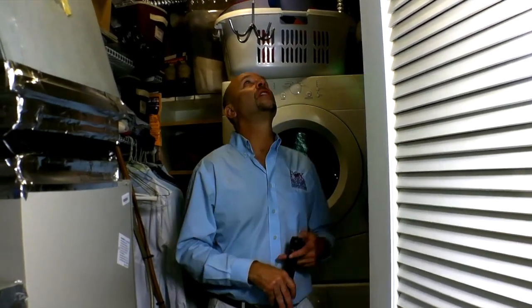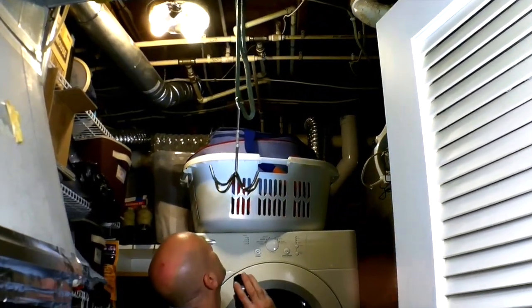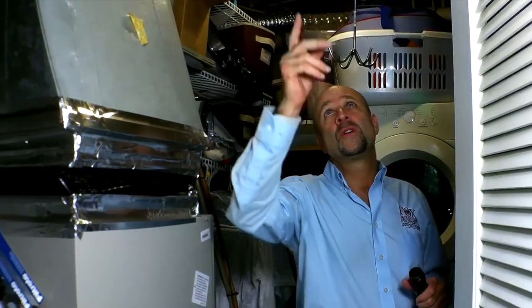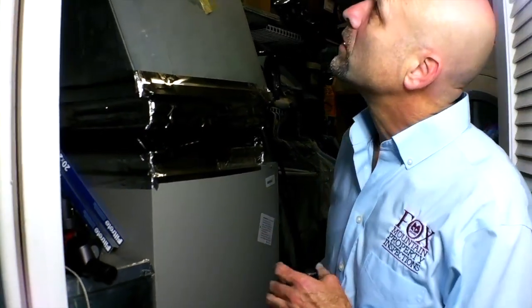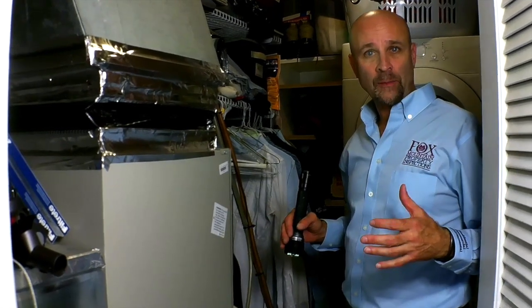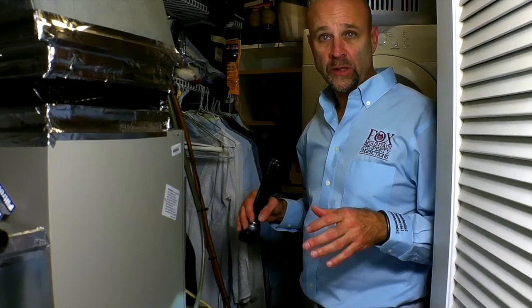So I would start with looking at structure, and we have 2x8 floor joists in here, about 16 inches on center. We're not doing a span calculation or anything else here, but we do have a built-up beam going down. We've got metal columns attached to the top, and they're buried in concrete down there. We're going to look that the columns are visually plumb, meaning that they're straight. In a little room like this, we could spend the most amount of time of any room on a home inspection, just because we've got so many different categories of components.